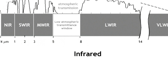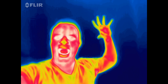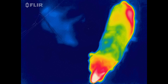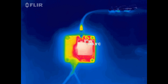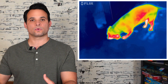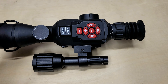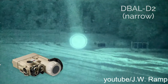If we go way beyond the shortwave infrared, we get into what's known as thermal imaging, which is my absolute favorite. It allows you to do crazy things like see my pet's footprints, see my footprints as I walk around, and even see where my dog's been laying because his heat is dumped into the floor. You can also see thermal loads on electronics, which is what I did to improve the heat sink placement on the video transmitter board in this project. Thermal imagers are seeing radiated heat from the source, so they don't need external illumination. And if you're using an illuminator to supplement your night vision, you will stand out like a sore thumb to anyone else using night vision because that illuminator will look like a spotlight to them.